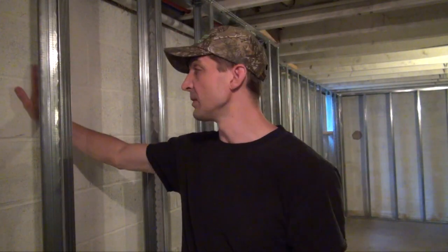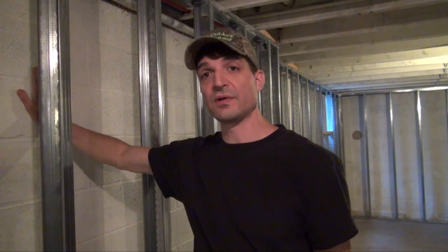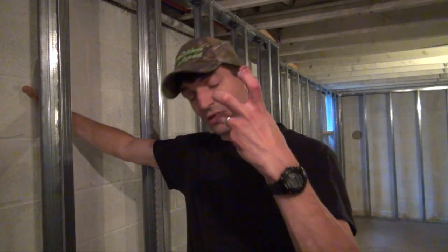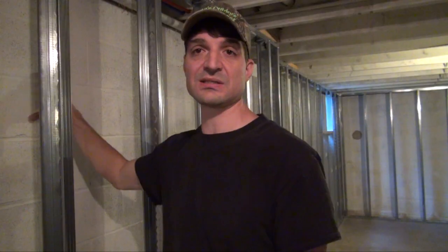There's a membrane or paint-type waterproofing substance on this wall, and I'll talk more about that in a few minutes. What I've found in many situations is the plastic up against the wall caused condensation and moisture to get back in there, with mold growing all over the material. I always discourage people from using this type of coating on a basement wall — it does not solve a moisture problem, although a lot of them claim they do.